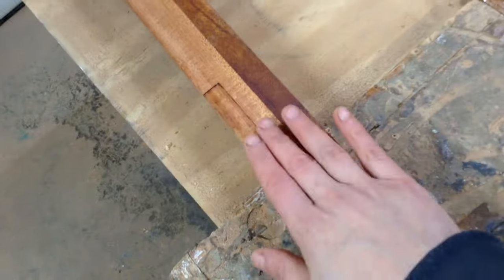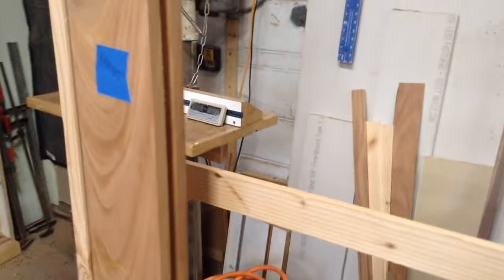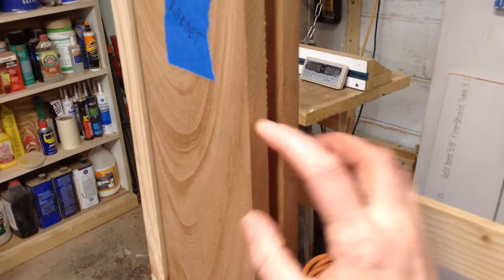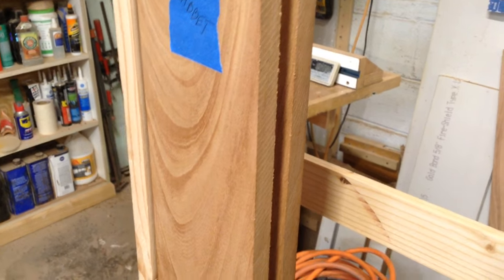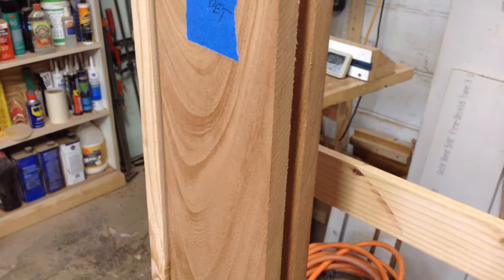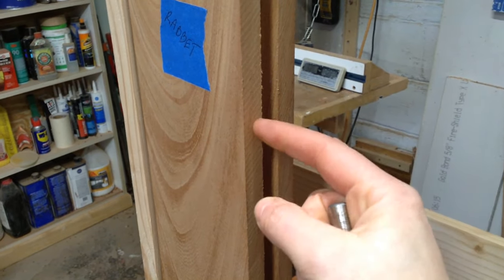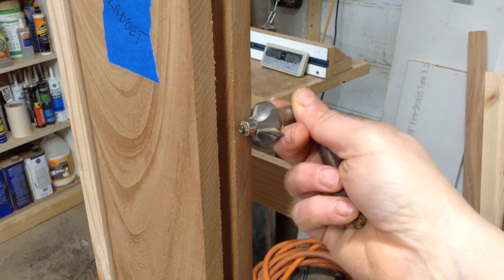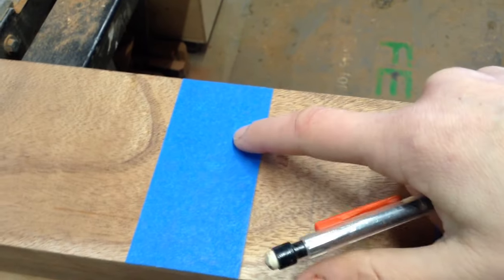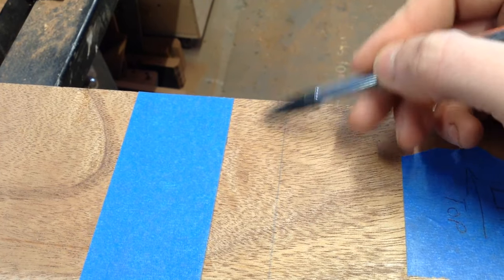This video got kind of long so I'm going to focus mostly on the horizontals; I'll deal with the verticals in the next video. To start, I need to begin profiling my door. I can make doors in a shop like this — the process is just going to be a little different and longer because I don't have industrial grade tools. I'm going to be using a rabbet on the backside, and it's going to be a little faster cutting it on the table saw.